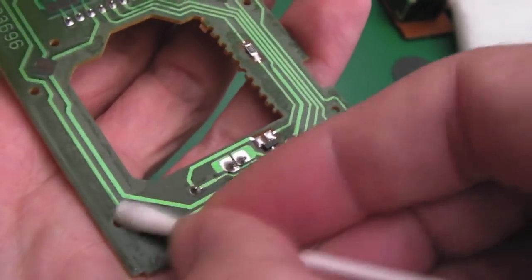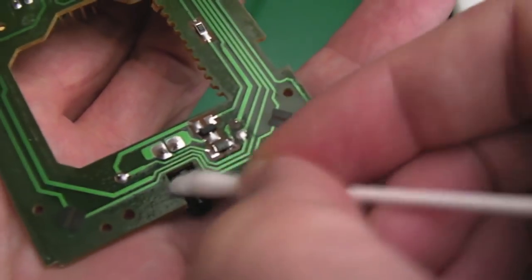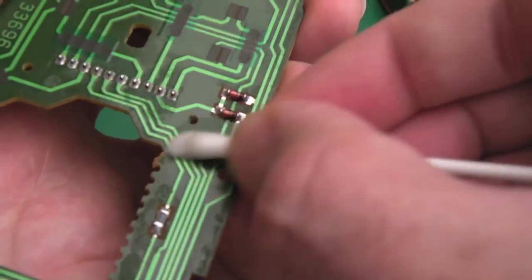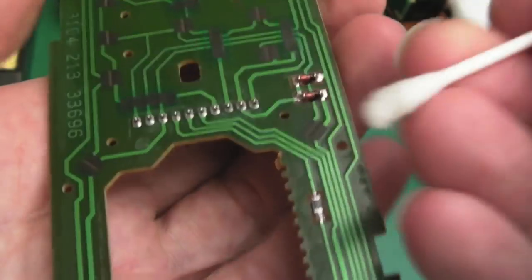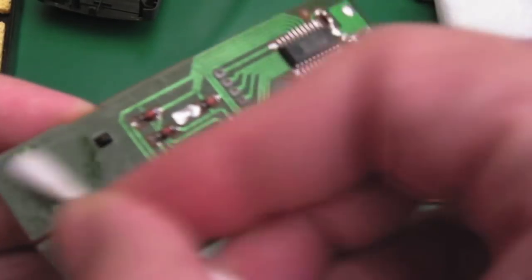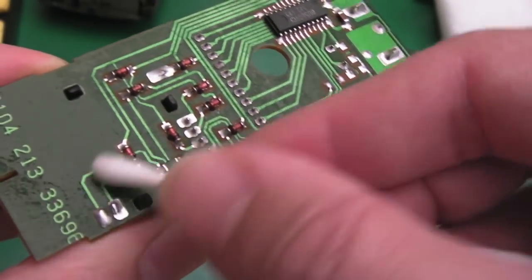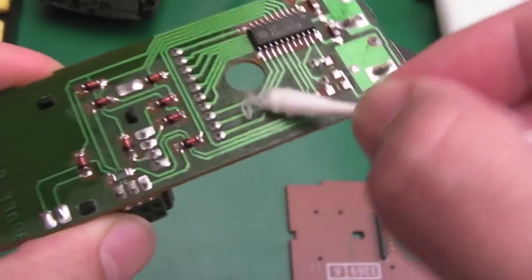We could clean up around here as well, because there's a bit of discoloration there — maybe from flux, or a bit of moisture has got in that area. It won't do any harm to just clean those areas down and wipe them down. I'll do both those buttons, and also around that connector there because there's a bit of flux or something. Technically we don't need to do this board, but why not? It's got some discoloration there, like some moisture over the years has got on there. So we may as well just give this board a bit of a clean-up while we're here.